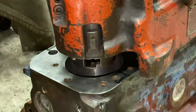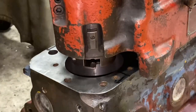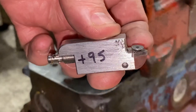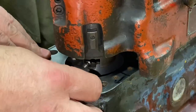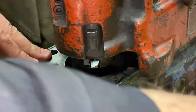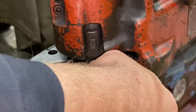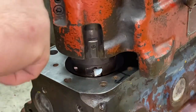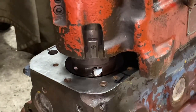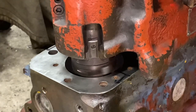This time, instead of the 75, we put the next size up, which is our 95. Always wipe the back of the stop, push it into the slot, make sure it goes all the way down and tight. Offset dialled in, cutter in position — now we just need to connect the power, start the machine and bore again. Start the machine, go to the feed and away we go.